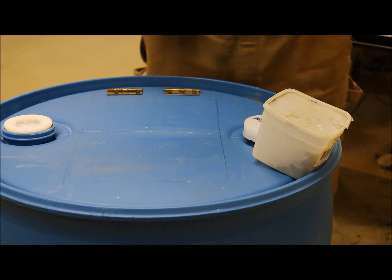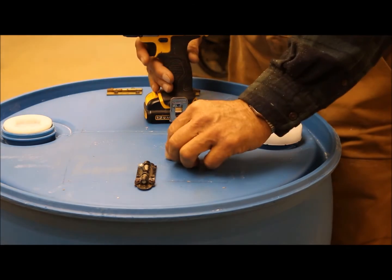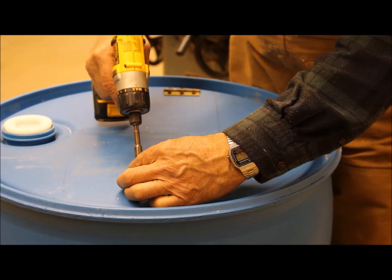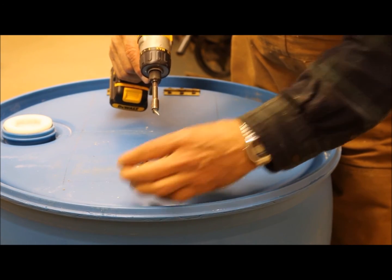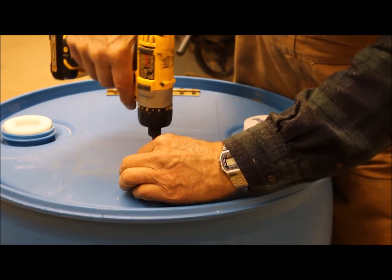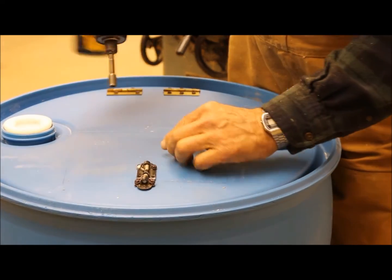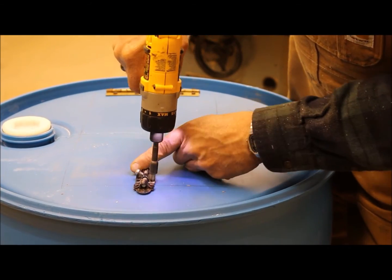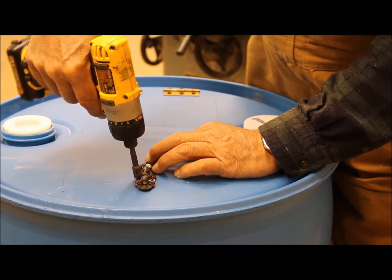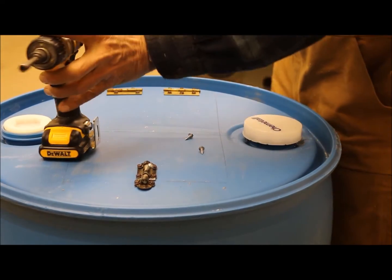What I'm going to do next is remove the hinges and then cut the lid out. But before that, I also decided to add a slide bolt to the other side of the lid. I want to line up the slide bolt as well — it will help keep the lid locked in place. I'm adding zip screws on the slide bolt: four from one end and two on the other, so all the holes are pre-lined up.